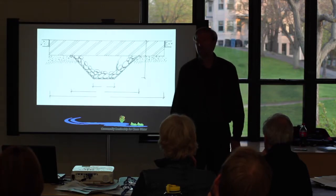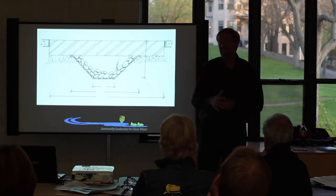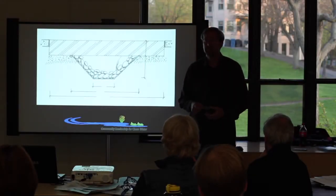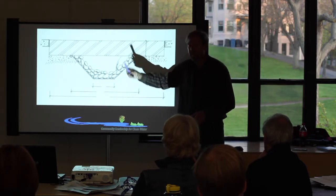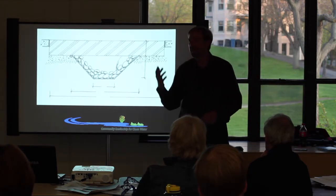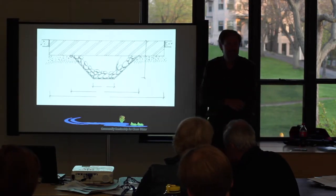The 4-inch thickness is what matters, and especially if you do something with granite. You're never going to make a span 10 feet or something like that, but I've made some that are 8 feet, no issues. Except for cost. If you do that, you can get slabs like this at Cold Spring Quarry for like $150. They're pieces that were going to be granite countertops, and they were failures for whatever reason. They throw them in their junk pile. You go on at Cold Spring Quarry in Cold Spring, Minnesota.